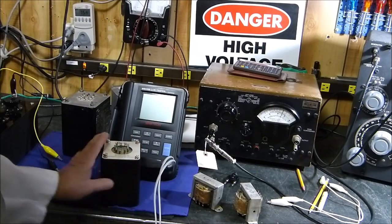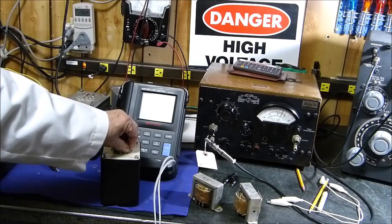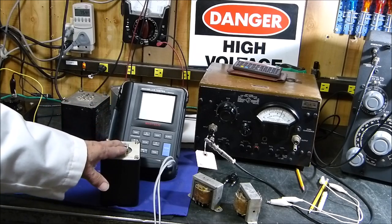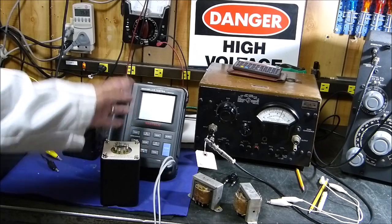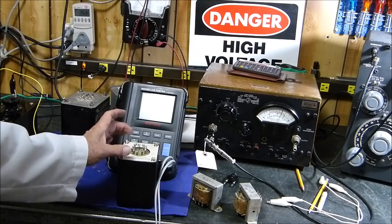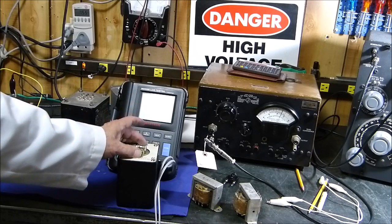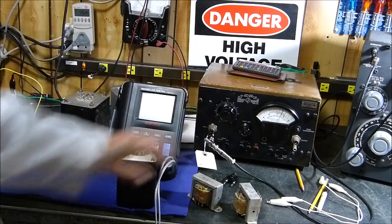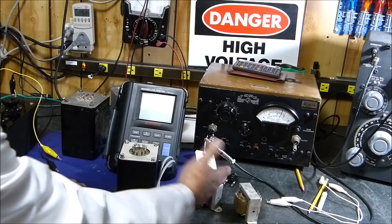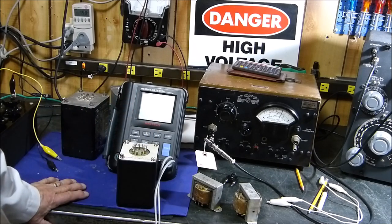and we have like an 8,000 ohm primary and an 8 ohm secondary, if we change that 8 ohm secondary to 4 ohms, mathematically it would change our 8,000 ohm primary to 4,000 ohms. Or if we had an 8 ohm tap, I'm assuming we only have an 8 ohm tap. It's not about this particular transformer. But suppose you've got a transformer that has one 8,000 ohm primary that goes to your push pull plates, and you have a secondary, it's 8 ohms. That's all you got. Well, if you put a 4 ohm speaker or load on your 8 ohm secondary winding here, then mathematically, your primary impedance goes from 8,000 ohms to 4,000 ohms.